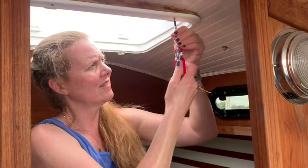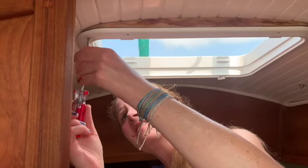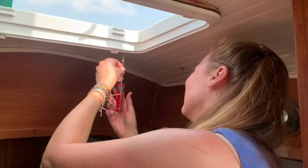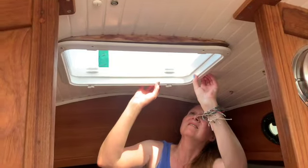The other thing I needed to check was the forward hatch to see how much water was leaking. I have this piece of plastic from our shrink wrap setup — there is a little bit of staining here, but it's just a very minuscule amount. To help diagnose the problem, I had reached out to my mentor Keith Scott of the Sailboat Company, and he sent me a list of instructions. The first thing he said to do was remove the inner frame from the hatch by unscrewing all the screws. From there, he said we could do the bucket test, and once we could see where the water was coming in from, we would know what steps to take.